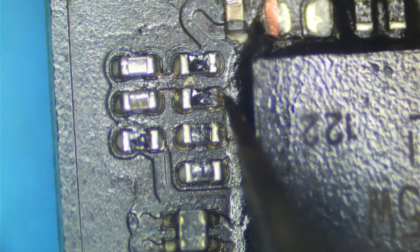All right, so I don't like this bubbling-like appearance on the top of this chip here. That could mean it got hot. It could just be something on the surface, and it's just something on the surface. Good. All right, so looking at this, I would say my issue is probably going to be related to this guy here. Everything else looks borderline okay. Little cap there. See, these guys are all right. These resistors could use a little touching up. I don't like the looks of this capacitor or this resistor right here, the top of it. But I'm going to let it be for now.